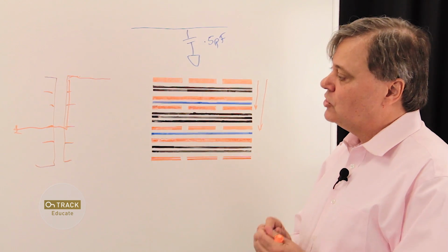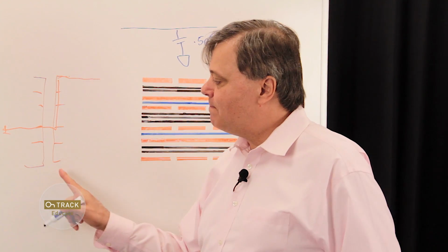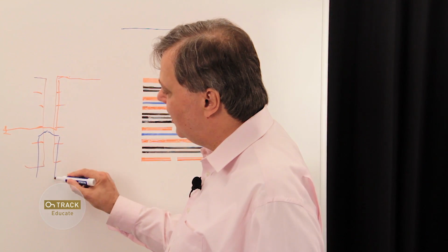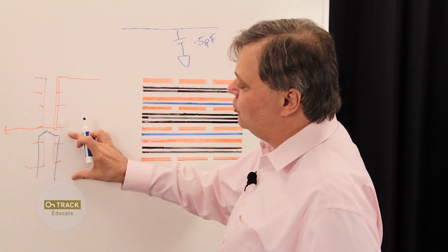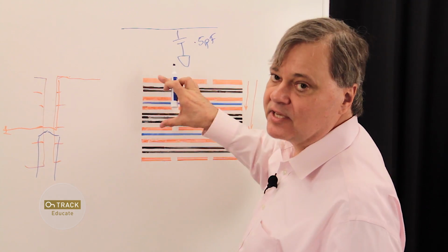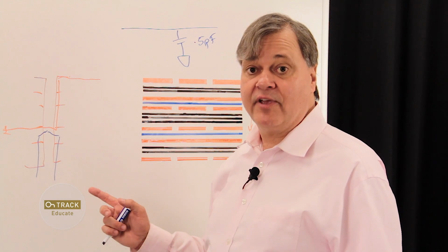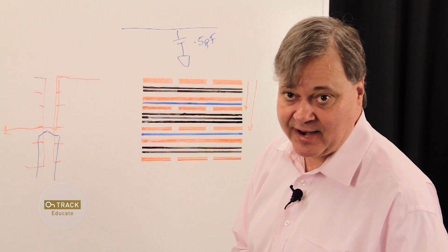This value is obviously going to be determined by the physical characteristics of our via, but this can really affect our signal integrity. So the approach we use when using through-hole vias on high-speed design is we back drill this via barrel to remove it. So we would take a drill that is slightly larger in diameter than the via barrel, and we would drill this material out. Now, when you do this, this isn't adding a lot of extra technology to this, in that we don't have to do any laser drilling to plate to vias that are difficult to get to. We simply use all through-hole vias, most cost-effective approach, and then back drill those particular vias as necessary.